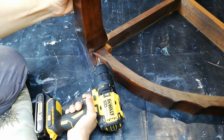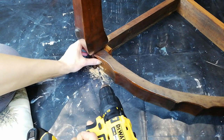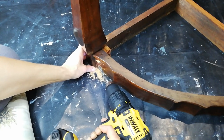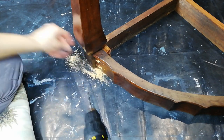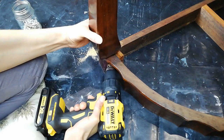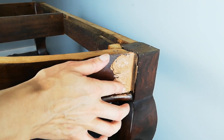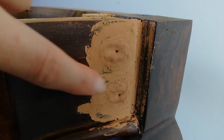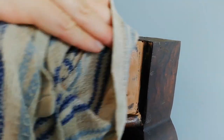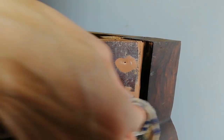I am securing the legs to get rid of the wobble. Applying a generous amount of wood filler, because when it dries it tends to shrink. I use a wet cloth to wipe down the excess dried filler, because I did not want to kick up dust from sanding it — it actually works faster than sanding it down.